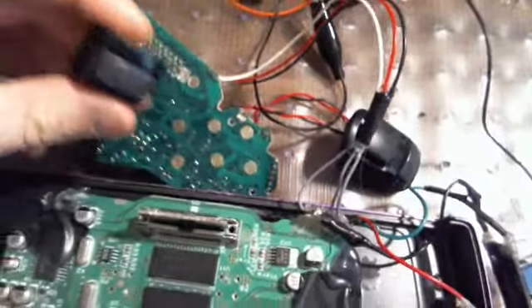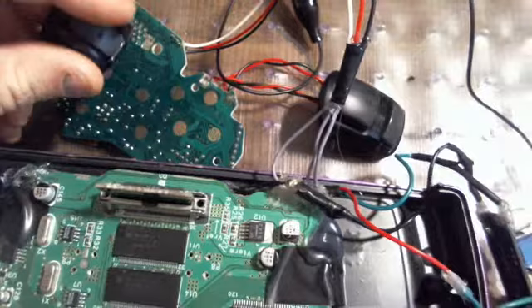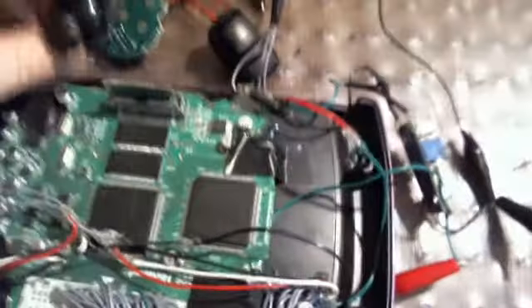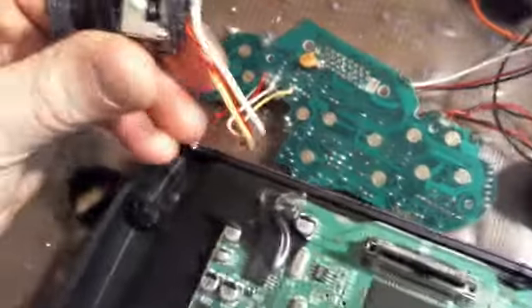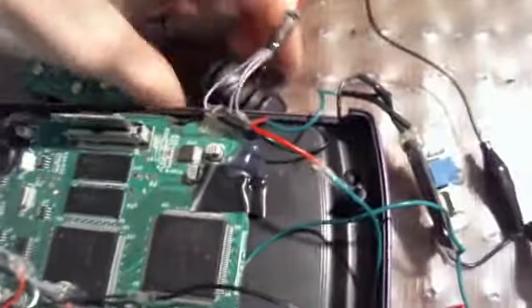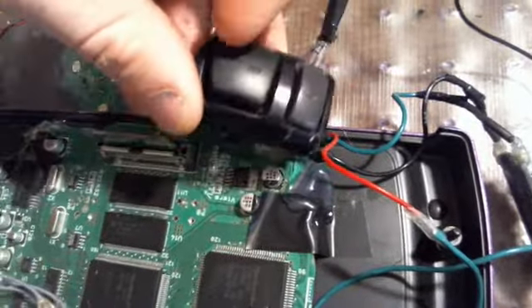I got these done yesterday. This is the left bumper for the left button on a Nintendo 64 controller. Then you got your PS2 analog stick as the analog stick for the N64 — I actually took off the little tact switch there, Dremeled it off, because there's not really a use for it. Here is the right bumper and then the Z button. I'm actually going to be installing them on the side here, so when you hold it you'll have your fingers on them.